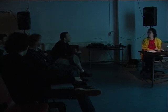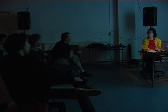The ADAT, do you multiplex the sensor channels on there? It's only like 8 channels of audio, right? So do you multiplex to get more channels? Yeah, I mean, it's a number. It's 192 bits per frame. Just put my data in. Yeah, we can just stuff it in there. Okay. Yeah. 1 bit afterwards.